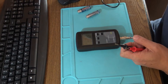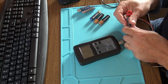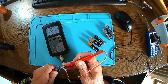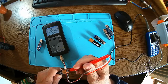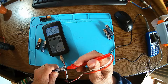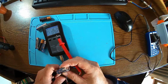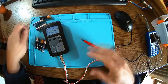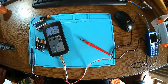Let's measure some alkaline batteries — ordinary used batteries. We got around 178 milli-ohms, then 190, 183, 184, 200 milli-ohms — those are basically wasted batteries. 213 milli-ohms — I'm still using those for remote controls and similar low-drain devices.